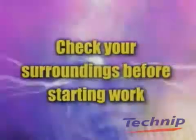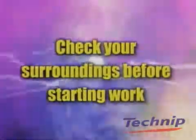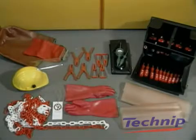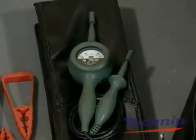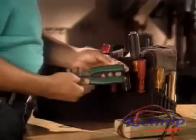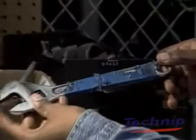Check your surroundings before you start work. Check for potential sources of electricity near your workplace and ensure that all tools are in good condition. Tools used in electrical installation work must be equipped with insulating handles and can only be used within the limit of the authorized voltage. Always use the correct tools for the job. Homemade insulating tools are dangerous and should never be used. Always check that any insulating material is in good condition and not torn, cracked or worn.